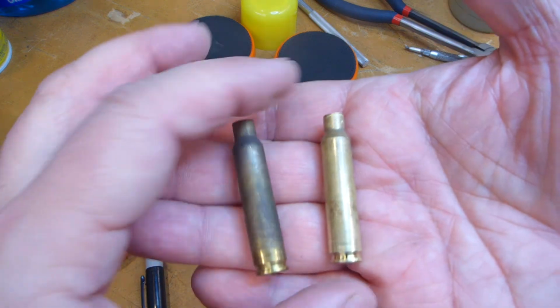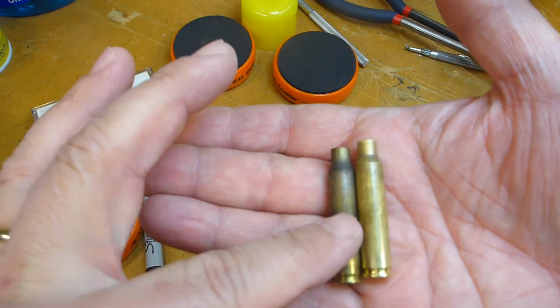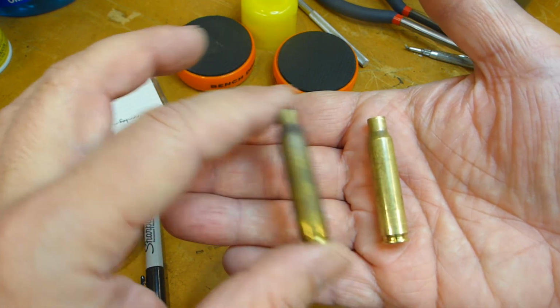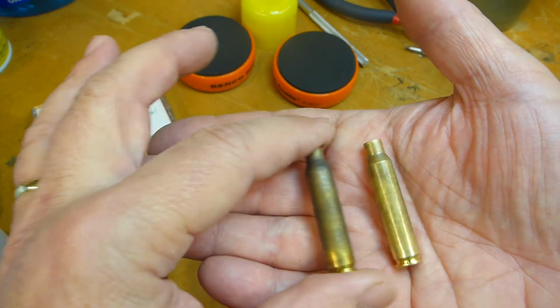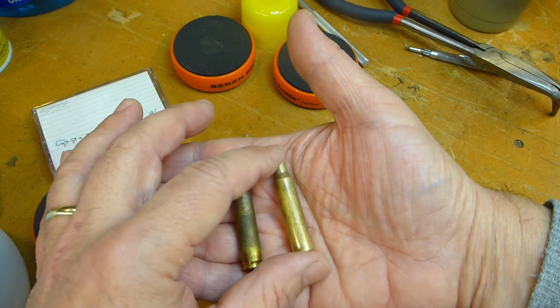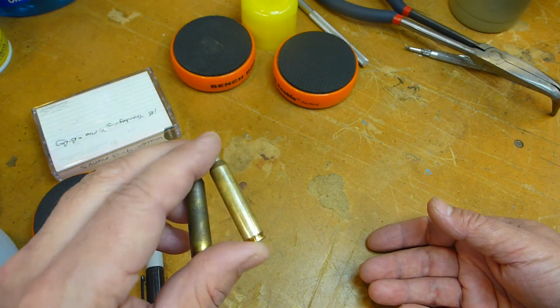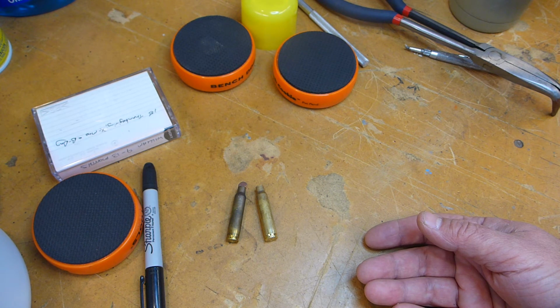So you know how you think of things too late? Just for giggles, I tried throwing this casing into that solution without the ultrasonic going, and it went in looking like this. About 15-20 minutes later, it looked like this. Dang it! I probably could have taken that clock movement that had all that flash corrosion on it and found a container of suitable size, poured that solution over it, submersed it completely, and probably would have gotten rid of the bulk of that flash corrosion after about 15 or 20 minutes. Too late now. It's all put back together, and I am going to be getting a bigger ultrasonic cleaner, so a year or two down the road, whenever the thing needs cleaning again, I will do it right.